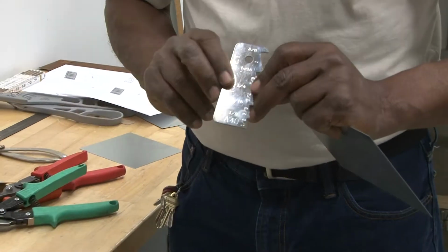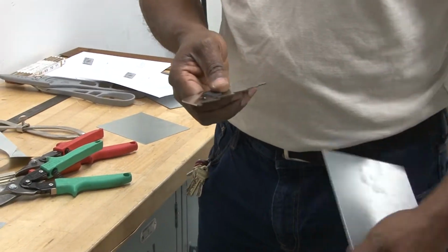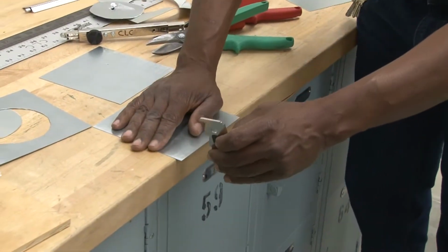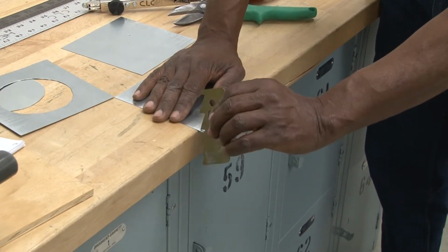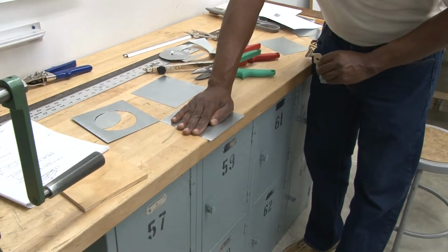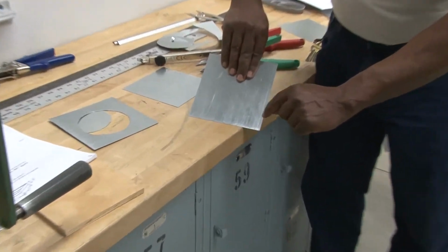To use that, you see the 1/4 inch on this level here, you flip it on the back side and you'll be able to scribe it. I'm going to try to do it backwards. I'm right-handed, so using my left hand. There we go. It's a 1/4 inch. I don't know if you can see it on here. If you can zoom in, it did a precise 1/4 inch without measuring it. That's the nice thing about these types of scribes. It saves you time when you're fabricating.